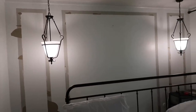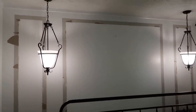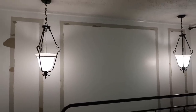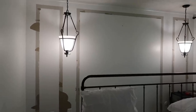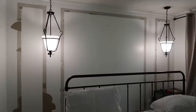We're doing some things in the room. We did this trim four years ago when we first moved in and we have a different idea of what we want to do on this wall. Thomas ripped all the trim off yesterday. He caulked it, so a lot of the sheetrock came up with it. He's going to mud this whole thing, let it sit overnight, we'll sand it down tomorrow, and then we should be able to start painting first thing tomorrow.